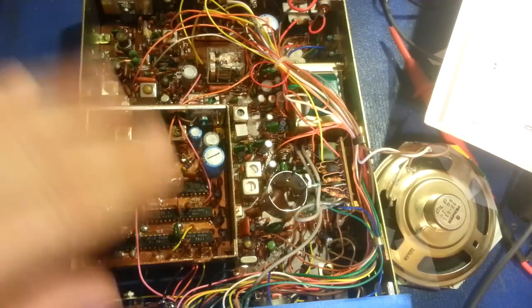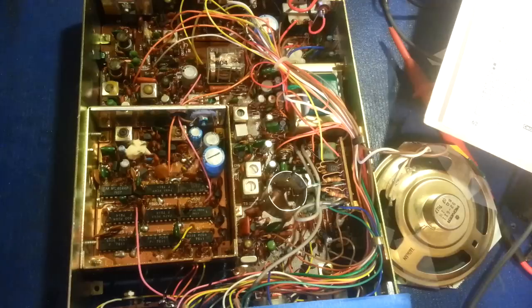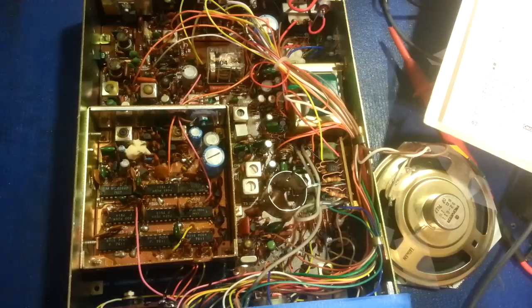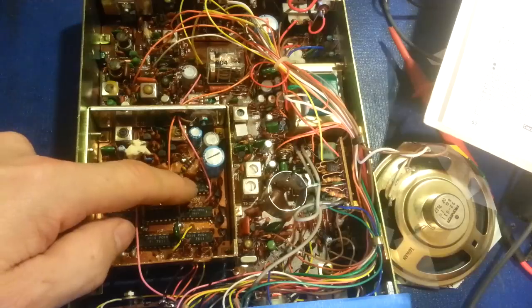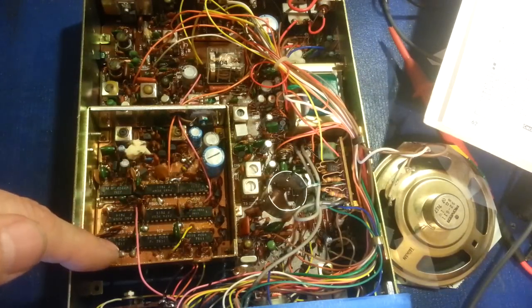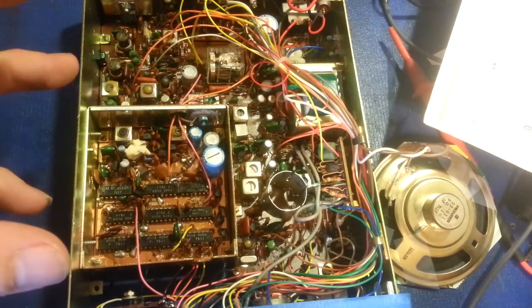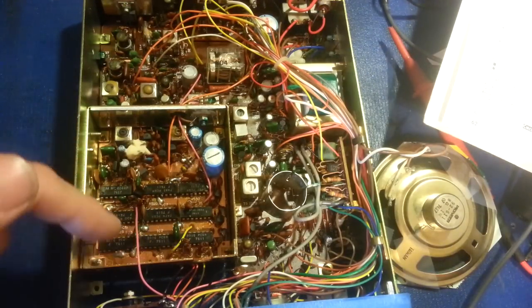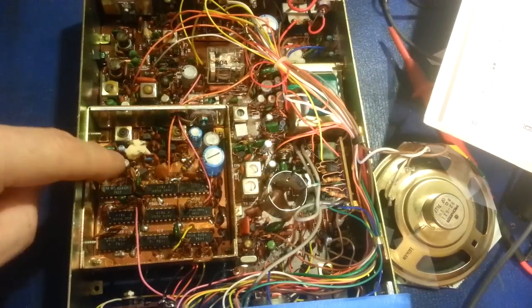If you have any technical experience with synthesizers, you'd expect to see one PLL chip — but you'll notice this has nine ICs. This is an extremely early solid-state PLL circuit, so it doesn't have a one-chip wonder. Everything is done with individual ICs — divider ICs, flip-flops, charge pump. Basically everything that would normally be housed in a single PLL IC is done here with multiple individual ICs.